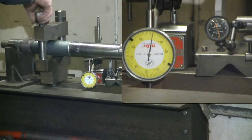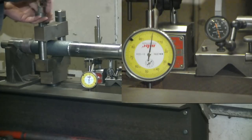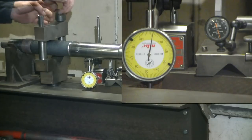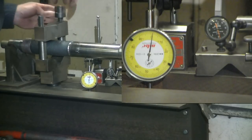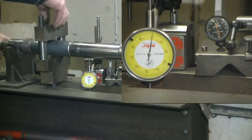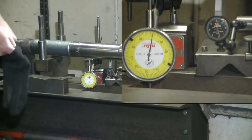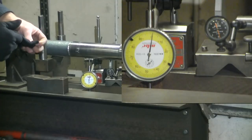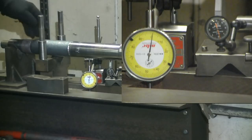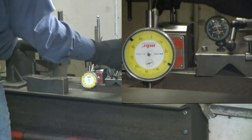Of the possibilities for straightening a shaft, the things I like best are: first, pushing it around like this; second best, pressing it from the top; third best, peening; and fourth best, heating and quenching. Any combination can have you chasing yourself for a while. These shafts will get straightened multiple times — when they rough turn I've got to check them, when I grind them I've got to check them, and when I cut the keyway in them they definitely bend again.